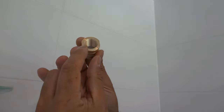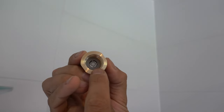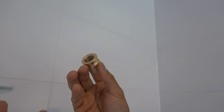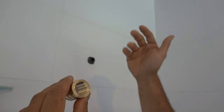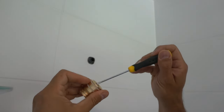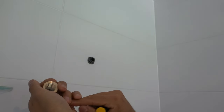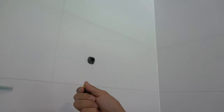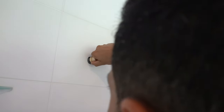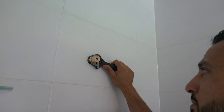Now we can install our first fitting — the one with threads on the inside. If you look right down the back you'll see a white piece of plastic called a water restrictor. What that does is reduce the flow of water, but on a double storey house it often reduces the water pressure a bit too much. So you can take a small flathead screwdriver, pop that in the back, and remove it. That gives you a nice clear unobstructed flow of water. Attach this fitting by hand first then follow through with an adjustable wrench, and be careful not to damage the surrounding tiles.